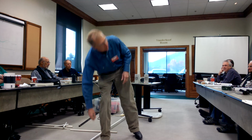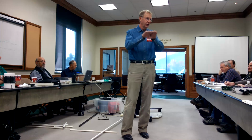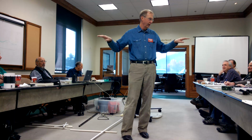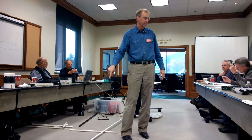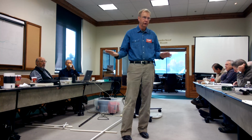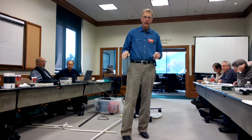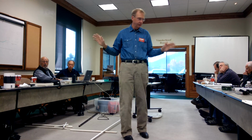Okay. And if you want to see antenna patterns, you can download a free copy of EZNEC, the software, and it'll show you that a vertical dipole has a pattern considerably lower than a ground-mounted quarter wavelength vertical, because the feed point is up a quarter wavelength off the ground, so you're losing less power to the ground. And there's no need for radials with this antenna, none at all. So whether it's up in the air as a horizontal or set as a vertical, no need for ground radials. You don't have to disturb the lawn or do anything like that.